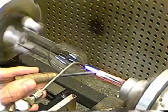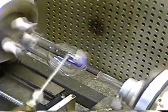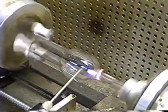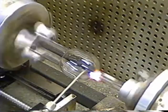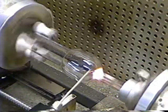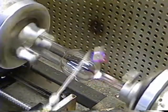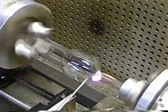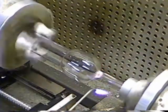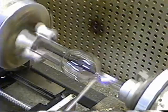Now we're just going to heat the two up. By using the lathe we can just push the two together. They're molten — I'm now pressing them together. I'm going to pull it back apart, then use pressure to go ahead and even out the glass. Heat it up. That seals it. Now I want to make sure that the tube is exactly on axis with the envelope, and it is.